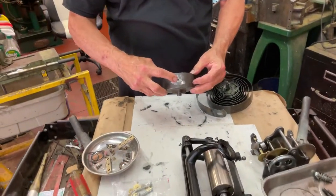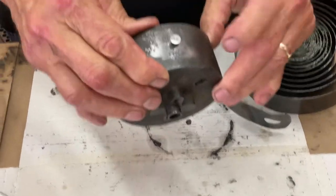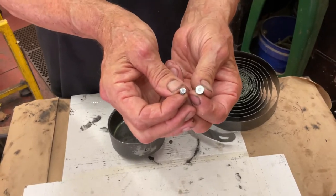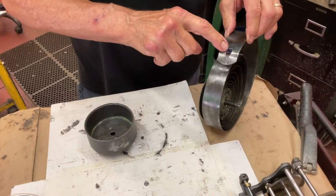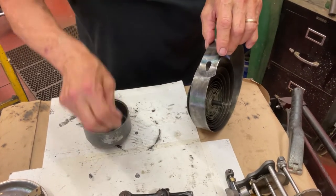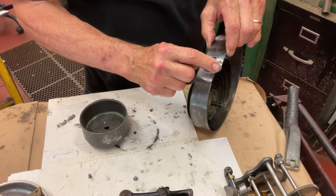You'll see the hole here, and that's because they riveted in this nipple into here. So we have this on the inside. But what happens on phonographs — this is the one I built, and this is the one that failed. Why did this one fail? On this spring, it happens to be an Edison spring. The pear shape is extremely wide at the end here. It's supposed to be much tighter — you should have a more pronounced pear. Because the center right here in the middle, that catches it. And the reason I didn't grind this down into a smaller area was there's not enough material left on the spring here.